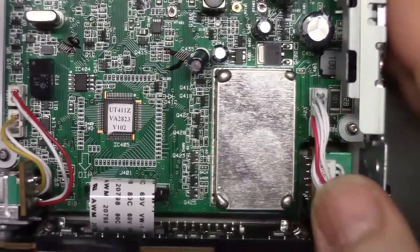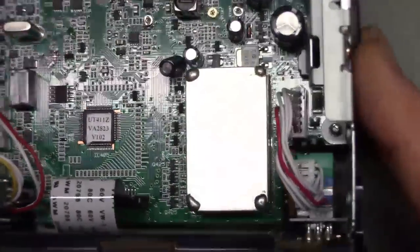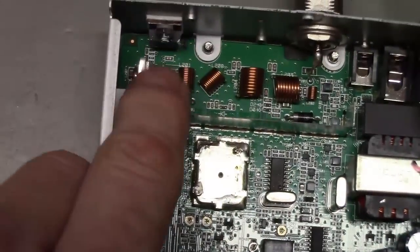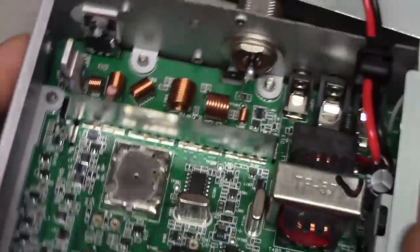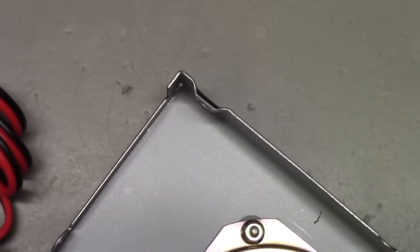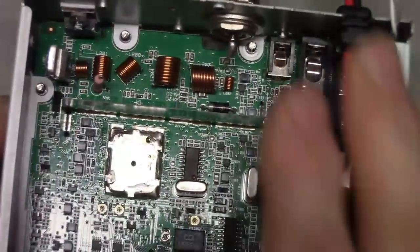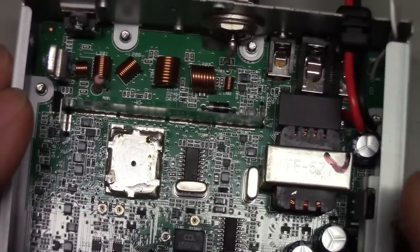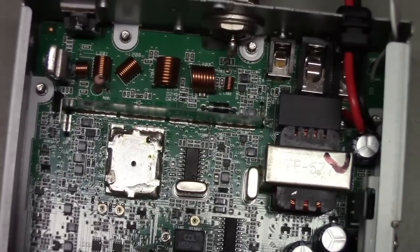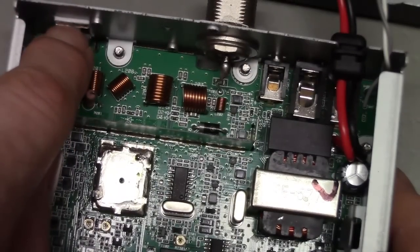There's our driver transistor with a little heat sink on it, and then there's the final transistor — it is the IRF520. They seem to use the IRF520 in the smaller radios. When you get into the bigger President radios, especially the exports, that's usually when you'll see the FQP13N10. Lots of companies use the IRF520s because they work just fine.